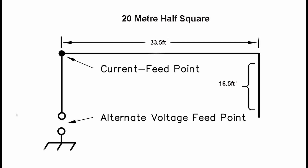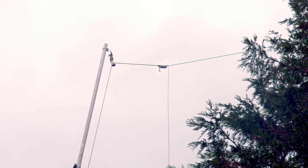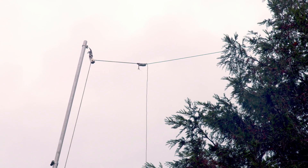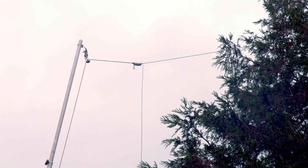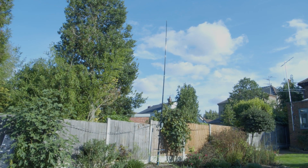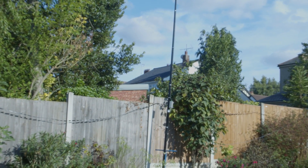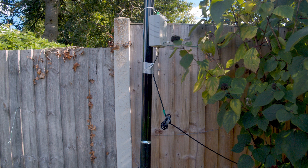This is the way I set it up. One end of the antenna is dropped down vertically, a meter away from the metal spider mast — that shouldn't cause any problems at all. The other end is run down the fiberglass mast, and I attach one of my homemade 49:1 ununs at the base — I'll try to remember to put a link at the bottom of this video. You need to make sure that you put a line isolator, and you can just see the line isolator at the feed point of the 49:1 unun.